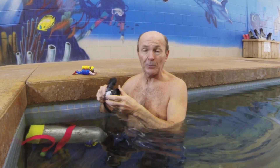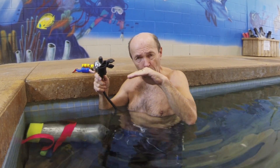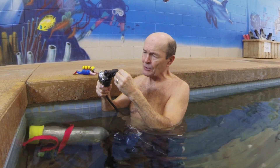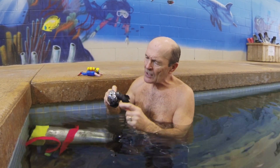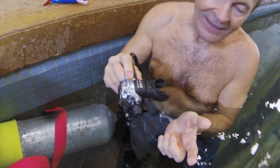So what's with the free flow? These are very sophisticated, very easy-breathing regulators. What do they have? A Venturi. A Venturi is simply an application of Bernoulli's principle, which uses the flow of air to draw the diaphragm in further. In practical terms, when you start to breathe on these high-flow sophisticated regulators, the airflow you started is used to draw the diaphragm in even further and give you more air. Right here is the Venturi switch — you can push that Venturi away from you. Now there's no Venturi.